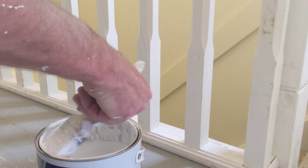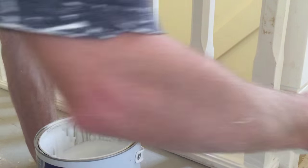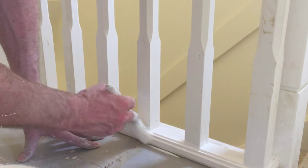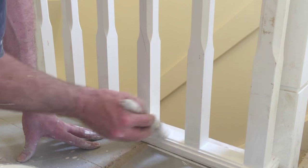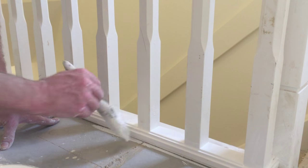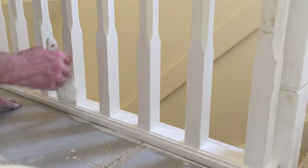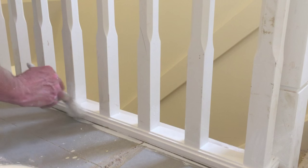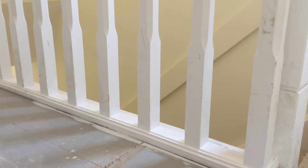So let me show you — here we go. I'm just going to basically show you on the tracking, which is the bit where the spindles sit in the tracking, and you've got the spaces in between. There's nothing wrong with doing it in water-based — you're doing your bit for the environment. But if you paint it in an oil-based, a lot of these really tiny little gaps won't fill up with the undercoat and gloss. You can pile it in and it'll just sink through the gaps, and then you're going to have to do a bit of filling — sometimes the oil-based undercoat and gloss will just about fill them gaps, but not all the time.